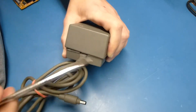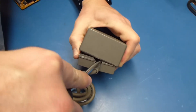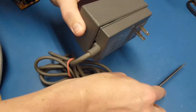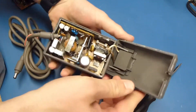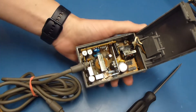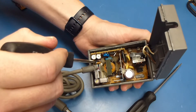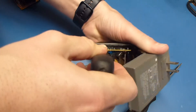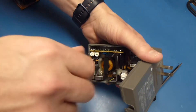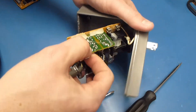We'll be able to glue this back together later, so it's not a big deal having it break right now. If I can get this other side to break, we'll be doing pretty good. So that's the glue — pop this guy off. And it doesn't smell bad or anything, that's pretty good. Now the circuit board is not just going to pop out. What we need to do is, right back here between these two pots and this capacitor, there's a screw way down at the bottom. Take a small Phillips number one screwdriver, put it down there, give it a few turns. The screw comes right out, and the board pops right out.